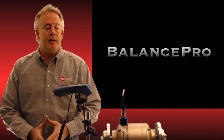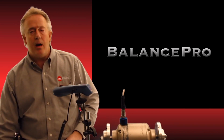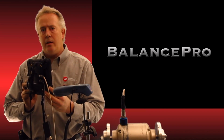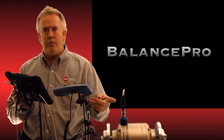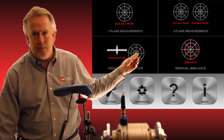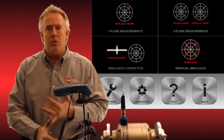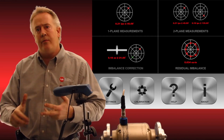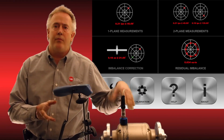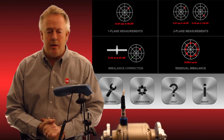We're here today to demonstrate our BalancePro software on the iPad. I have an iPad Air here with our 2-channel DAQ, one for the tach, one for the accelerometer. Behind me on my left is the first page of the app, showing that we have a 2-plane balance mode, a single plane balance mode, a field balance mode, and we can also balance on stanchions for replacement electronics for existing balancing machines that are out there.